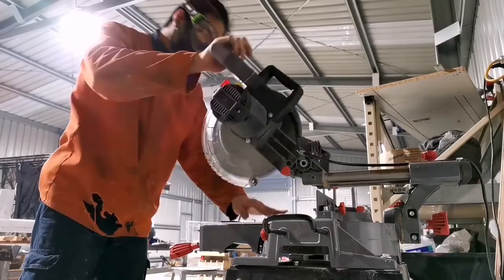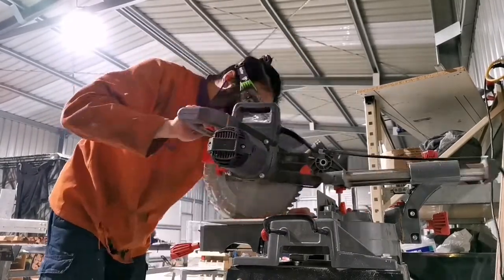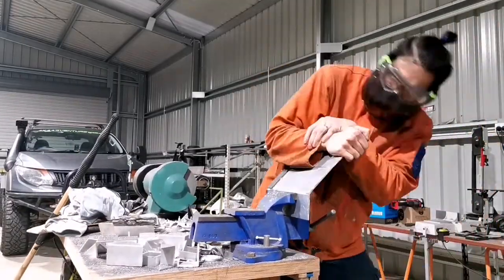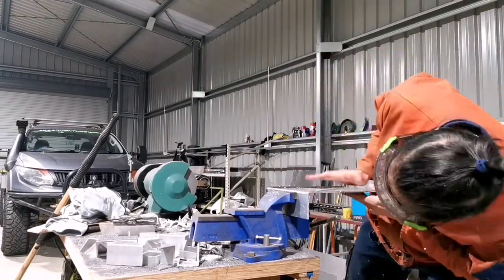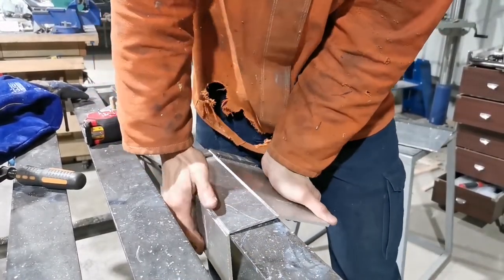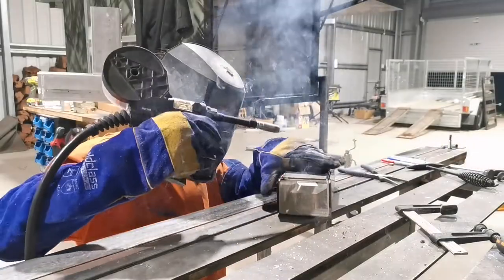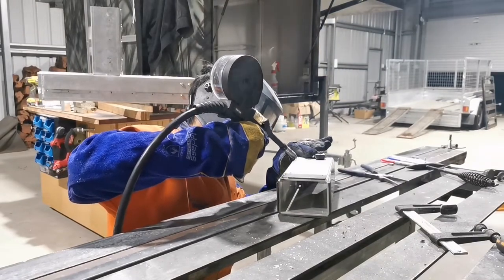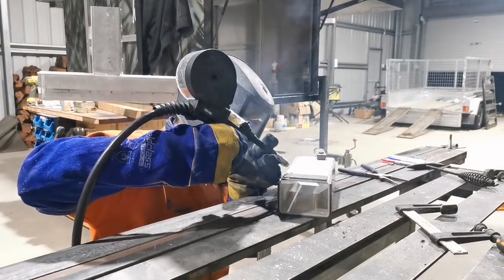The part that connects the wheel carrier plate and the post is made of 4mm aluminium sheet. This 4mm aluminium sheet was actually from a drawer system that is no longer in use. Luckily I have it and I cut out the right size, used the miter saw to cut some shallow lines, and then it makes it easier to bend. So essentially it becomes a rectangular hollow section, and ultimately I just used the spool gun to weld the corners and strengthen the whole structure.